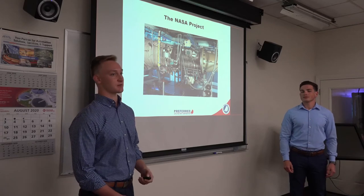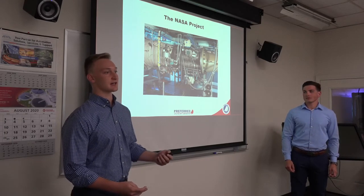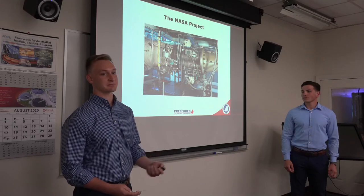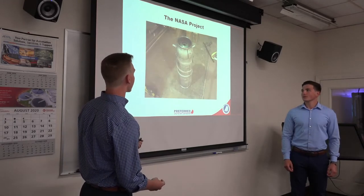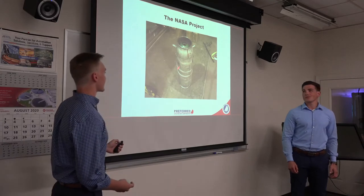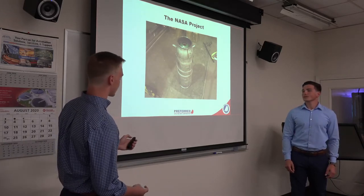Except when they didn't have a lot of oxygen going in, the flame was going out. So they wanted to be able to use less oxygen and still have the flame going, just to improve efficiency. They recognized Preferred's skill in burner technology, so they came to us and asked us for help with that. And this is the part that I primarily worked on. It's called the combustion can. You have this outer casing here, and then you have the inner liner, which is mainly what I worked on.